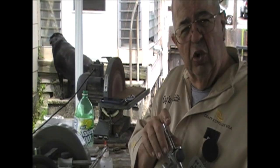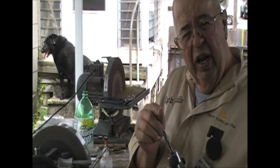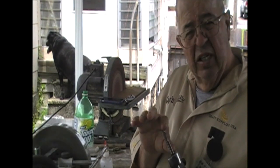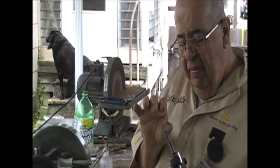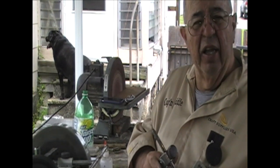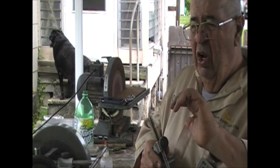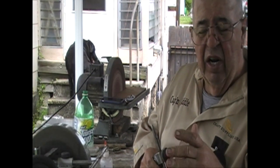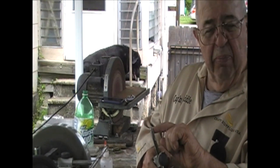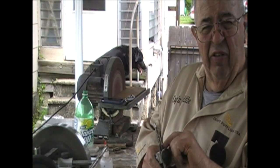But I've got this tool now. I've removed any claws on it, and I went through and I dressed off the edge, and that is razor sharp. But little bitty teeth on it, which means it'll cut like a bear. Now, when I'm doing a finial, or putting the detail in, or even going around the outside of an egg or whatever, I only cut with that point. I only need it sharp. I don't care about the rest of the stuff.